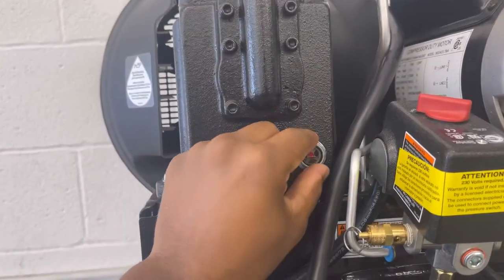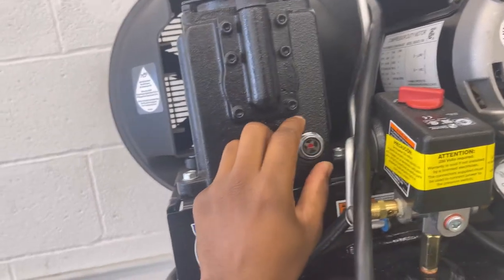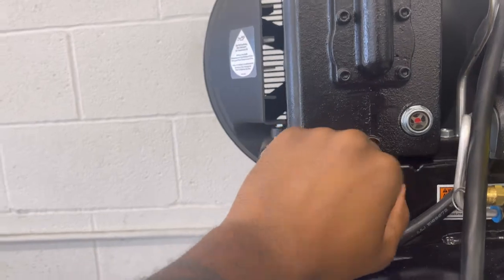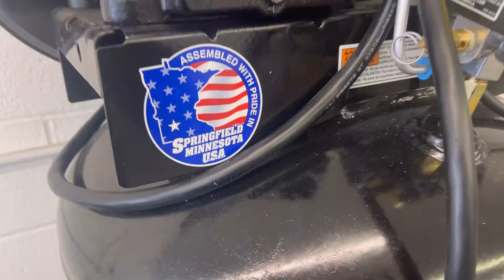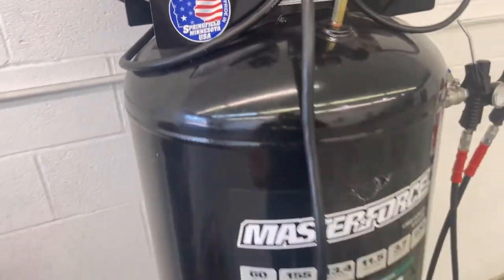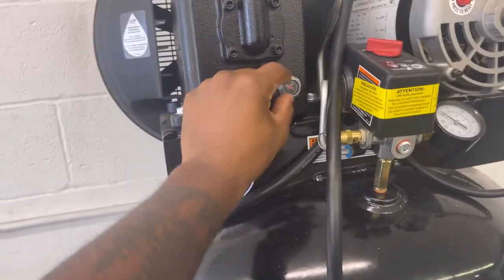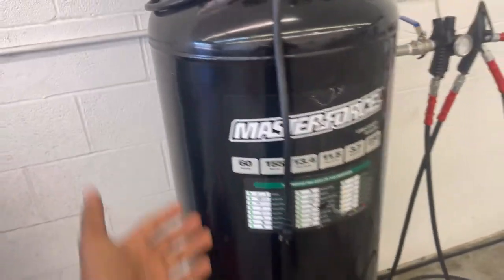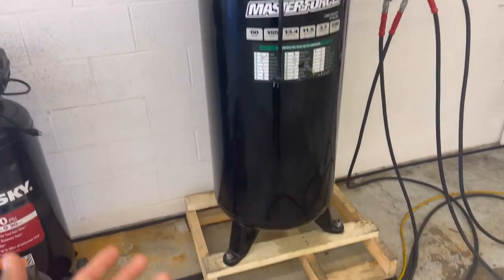So you would use an impact wrench to just knock this off, just like on the wheels when we're taking off wheels. You just unscrew that and then it drains out, which is kind of funky because there's like no spout or nothing. This is kind of one of the downfalls of getting this Masterforce. It's like there's no spout right here for the oil to leak out — it literally drips onto the air compressor itself. I just basically used a towel and then I had the drip pan, so that kind of worked out.